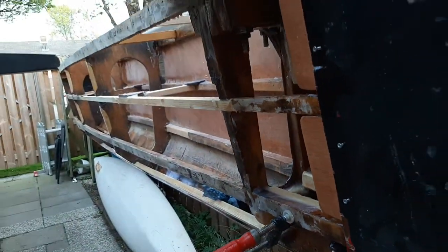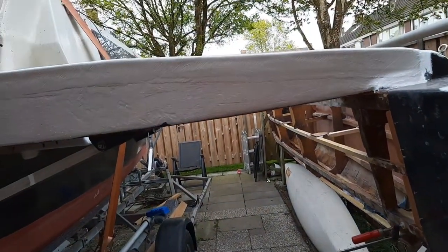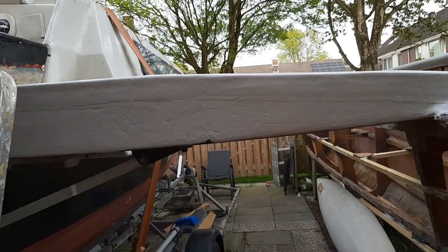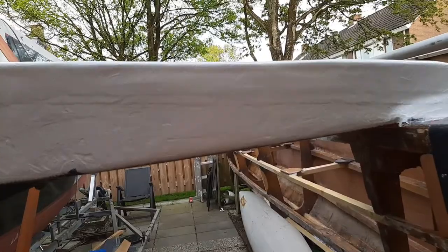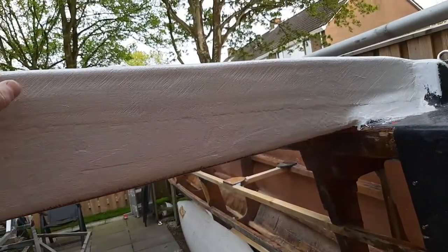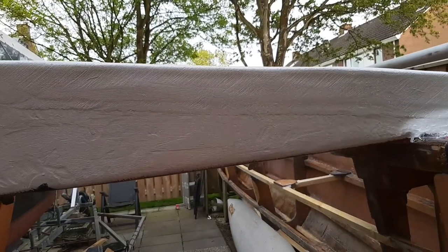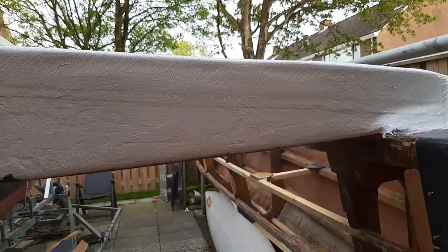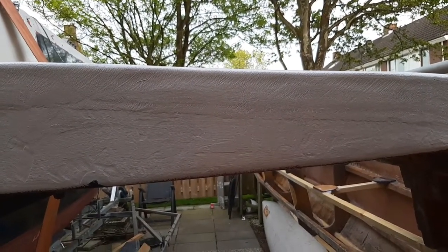There's the float from the other side. The rear beam was flexible on top — it had just taken too much of a beating and I didn't trust it. So I laminated a couple of layers of pretty strong material with six layers of uni-directional in between, so it's well stronger than the original specs. I removed all the wood that was on top — I'll show you that in a second.